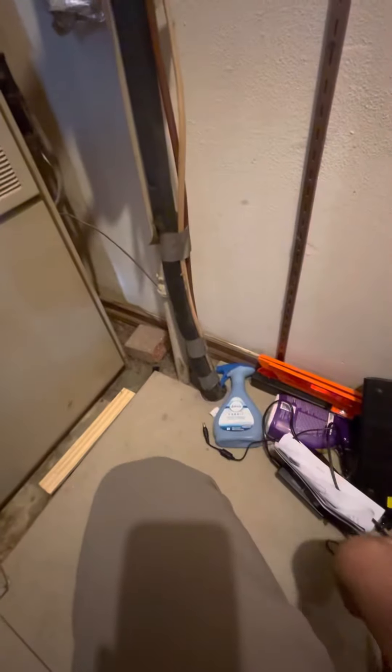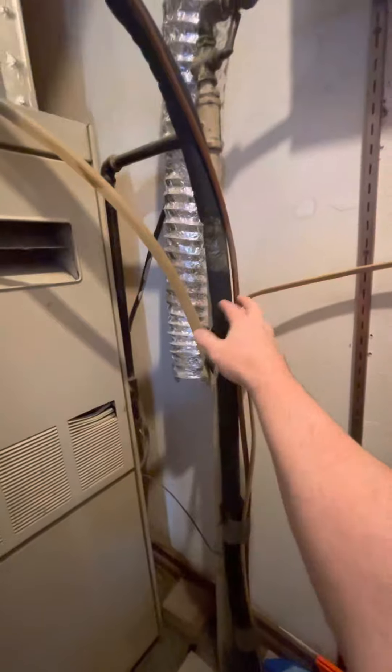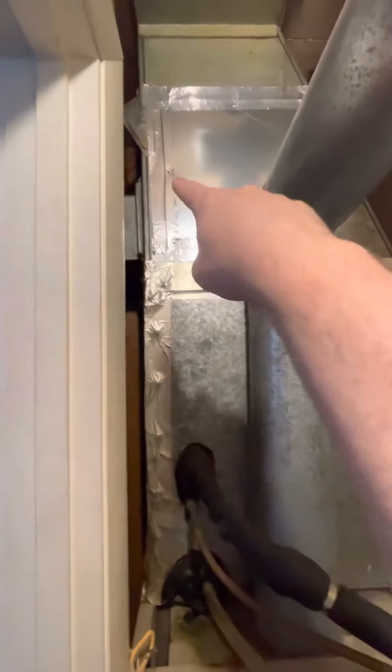The drain's running down into the crawl space back to the outside unit. I'll show you the line sets in a second — those will have to be cleaned and flushed out. The coil will be a B-width. This is all going to drop down and we'll have to rebuild the plenum. There is a supply coming right off the plenum here that'll have to get tied back in.